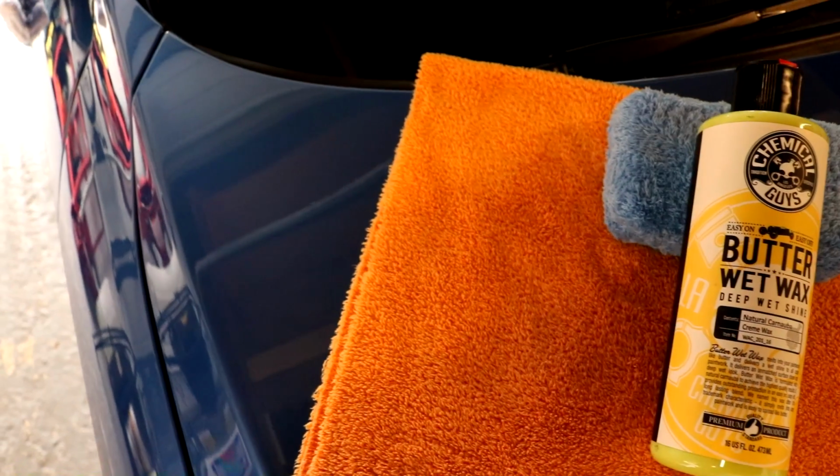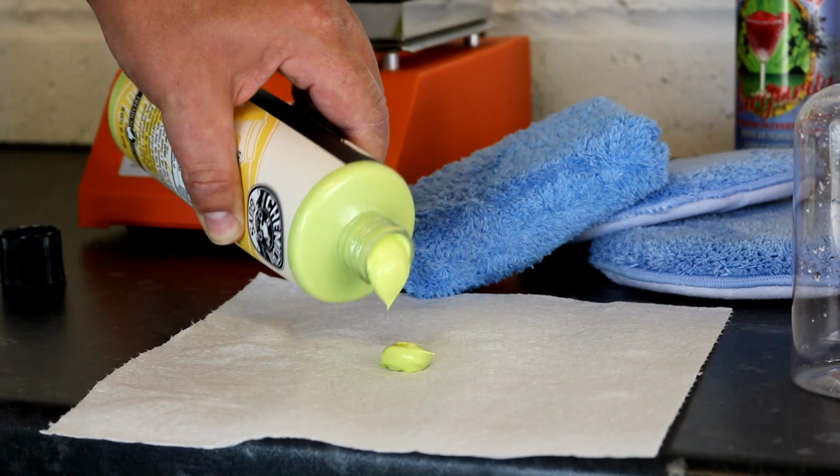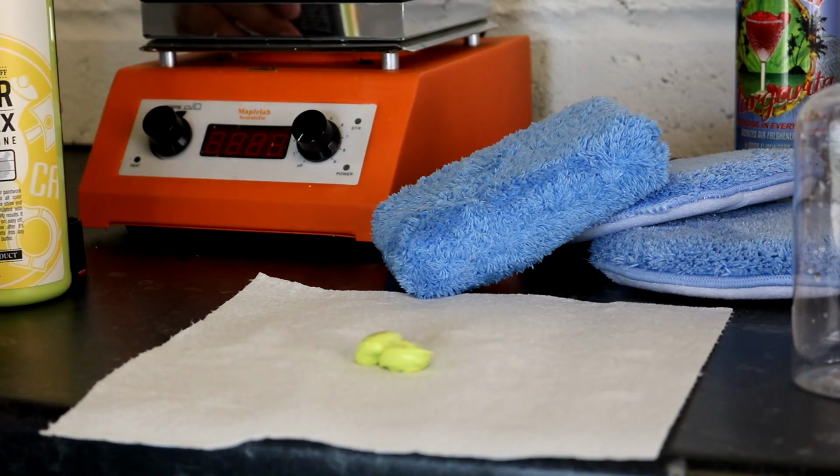Now, with wax-based emulsions, what you do is add an agent, an emulsifier, which allows your wax blend to be incorporated into products which don't normally mix. So that's what an emulsifier does. It allows two components to be mixed together that normally would not mix and would separate. In most wax emulsions, the ingredient they're wanting to put into the product is water. So the emulsifier allows your wax emulsion to be mixed with water, and you create a more liquid or fluid paste type product. And that gives you some advantages and disadvantages we're going to discuss next.